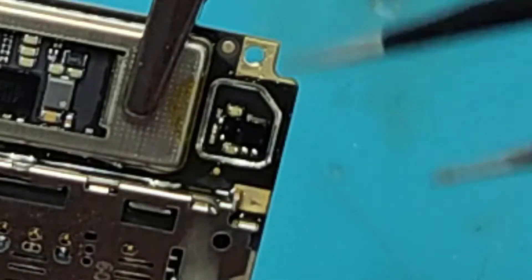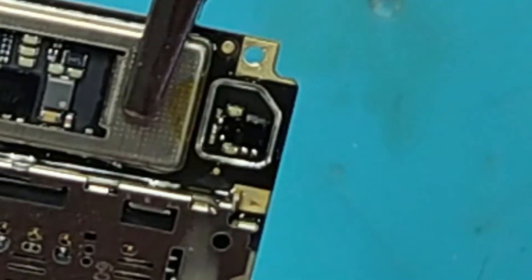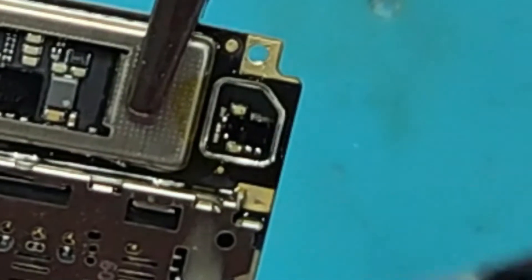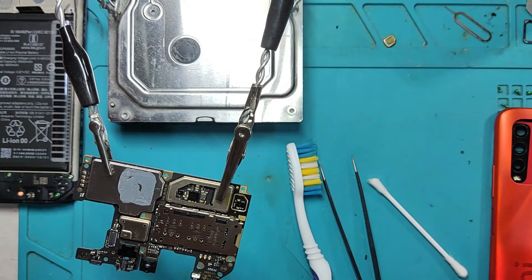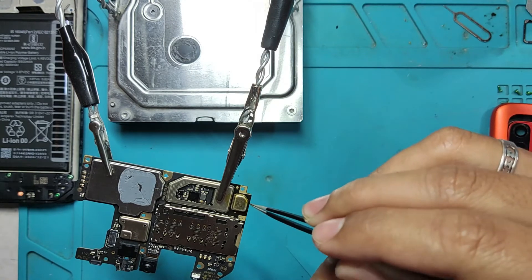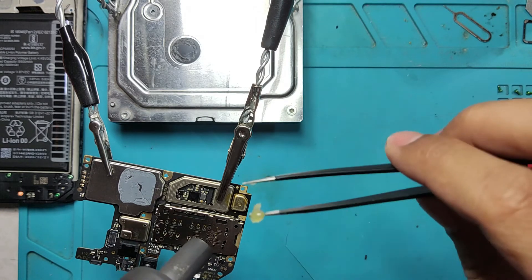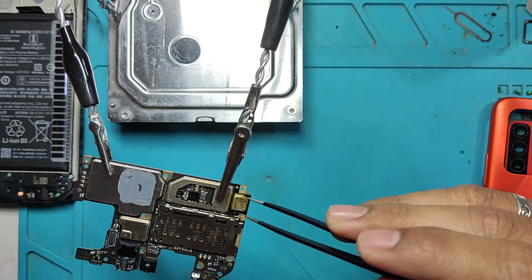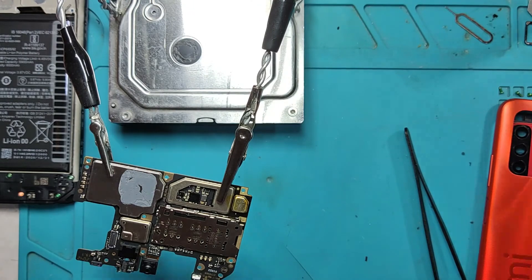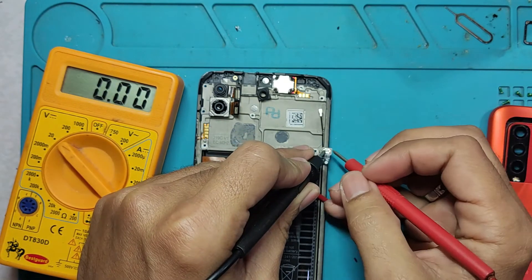This is the closer look — this is the IC that we have already flattened. As you can see, some of the tins are present around the IC, so we are going to remove them using a brush. If you cannot remove them with a brush, you can use the tip of a pointed tweezers. Be very careful so that you do not damage any surrounding components because they are very small and fragile. Now that we have flattened and cleaned that part of the motherboard, we need to put back the cover. We put some flux and place it back.